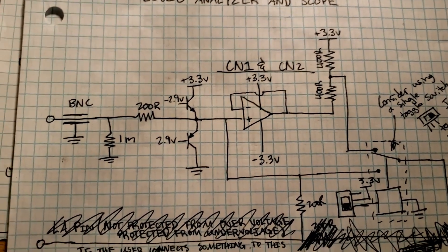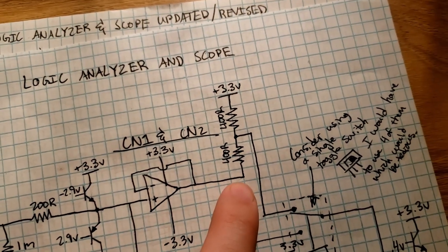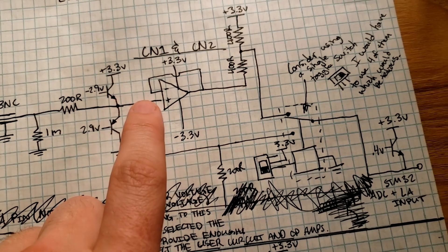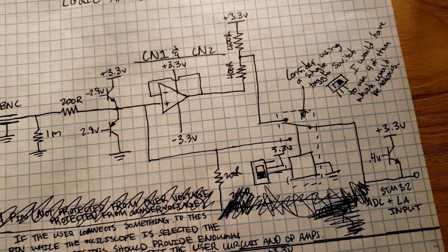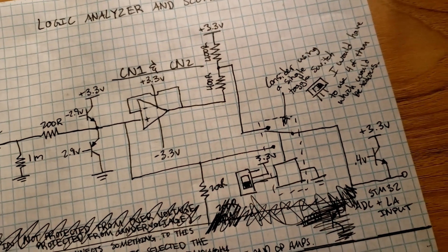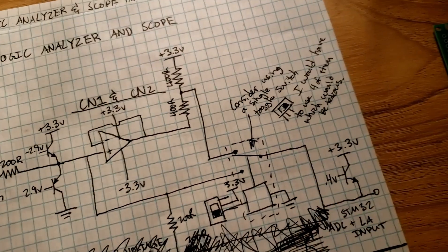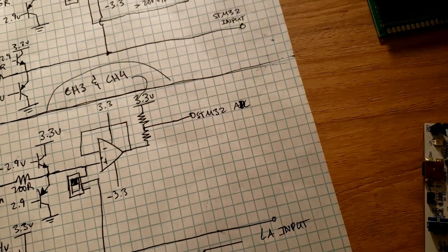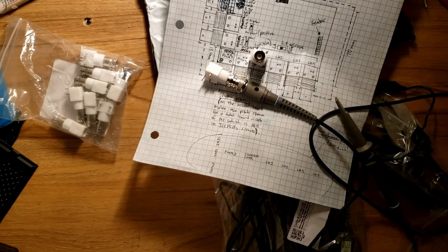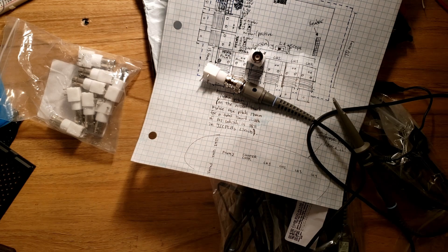In the scope section of the schematic I have my clamping circuitry with a reference of negative 2.9 volts and positive 2.9 volts for bipolar signals, made possible by the negative power supply. I have an op-amp buffer, and for scaling I'll use a 400 ohm resistor divider. For the logic analyzer mode I'll have a physical contact switch to bypass the buffer, with its own clamp — a zero volt low side clamp when going direct, versus a negative 2.9 volt clamp in the scaled path. There are some other cool additional features I'll get into in the next video. Thank you for watching and stay tuned!